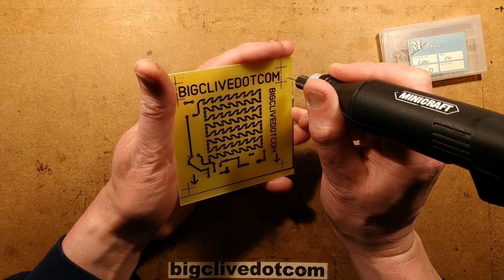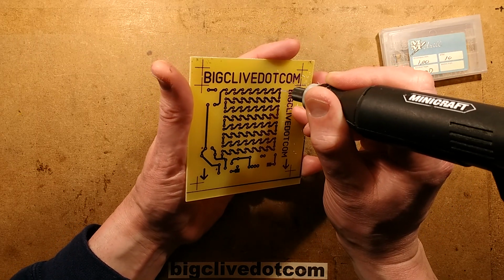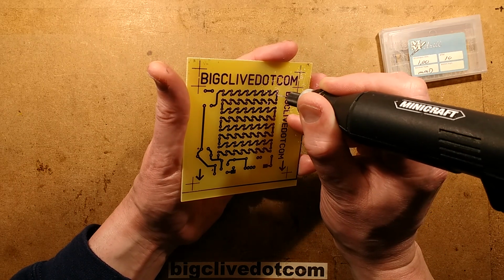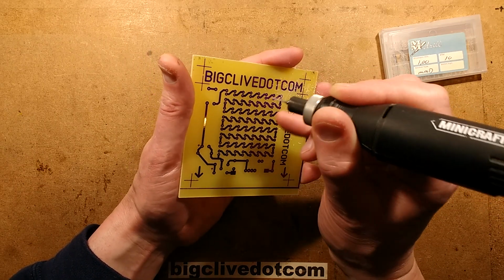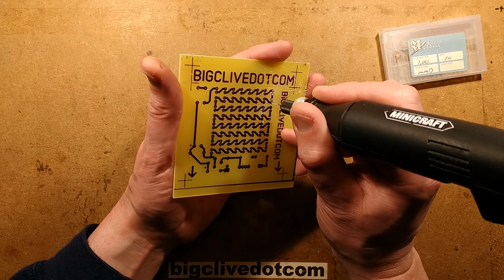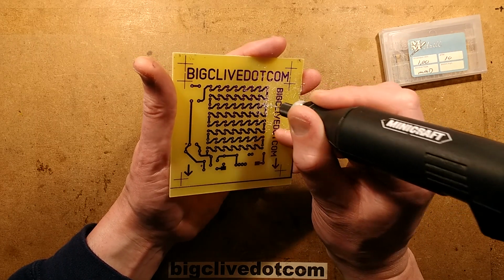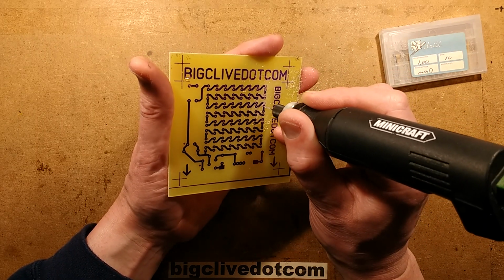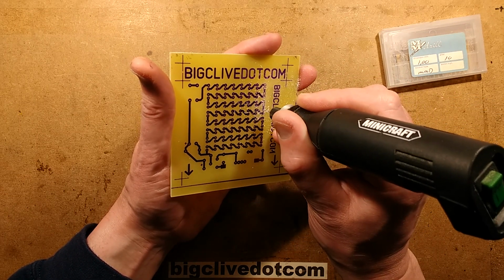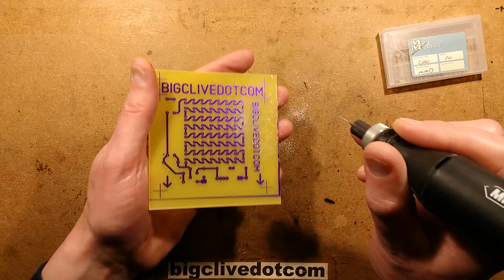So here's the test holes, and when you put it onto a pad like this one, it will kind of center itself. I'm using 1mm holes here because the LEDs are sitting hard down onto the circuit board. It's not necessarily a recommended way to mount LEDs, but in this case it aligns them up well, and by using a 1mm hole, it means that the slight meniscus of the resin of the LED will sit into that 1mm hole.